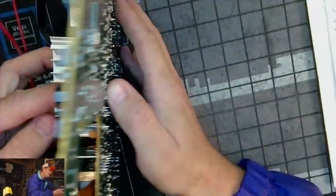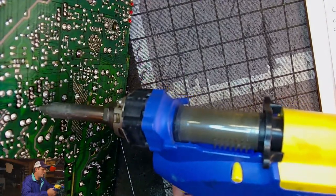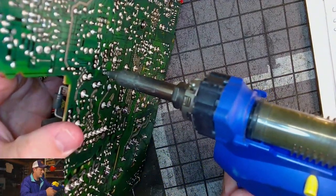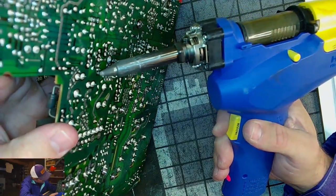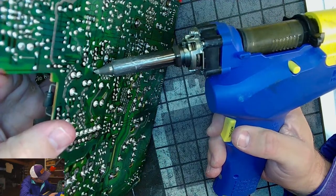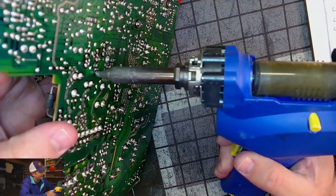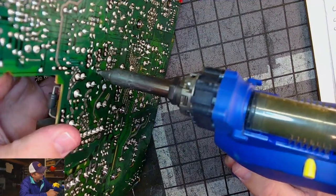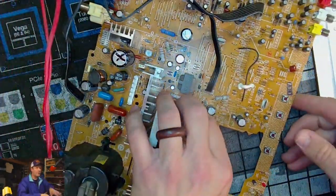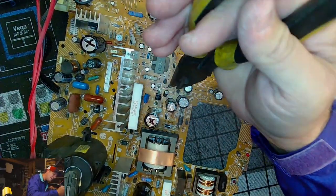Let's just go ahead and pull it first. If we can find it. There it is. It's right under. It's this one right here. Should be. Yeah, it's moving. Solder is just, I mean, really hideous. It's got some pretty nasty oxidation going on top of it. The other set was very clean. So this could be a situation where we end up finding that the caps might not be the issue. That it might just be the solder itself at the end of the day.